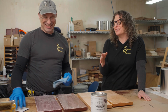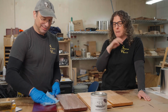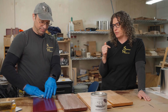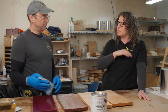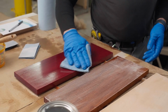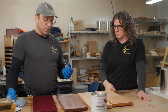So the hard oil, we haven't talked about this. The hard oil is one of our top coats in the Murdoch system. It is mostly resin with a little bit of tung oil, which is the inverse of our hard sealer. It can be its own finish. The hard oil? Oh, I love it. To me, it's a hybrid that isn't quite a wiping varnish. It doesn't have more tung oil, it has a little more resin in it. It gives a nice protective finish.